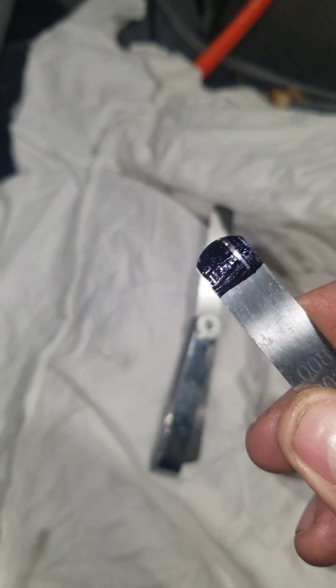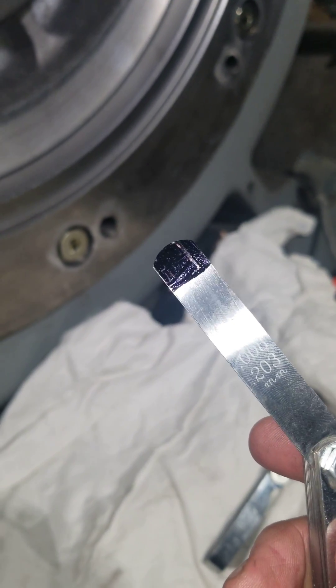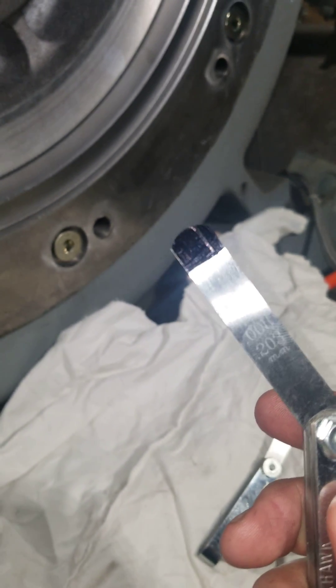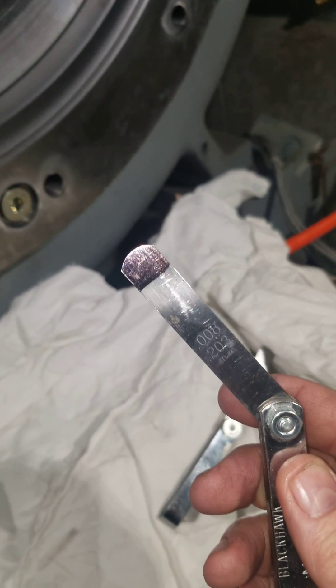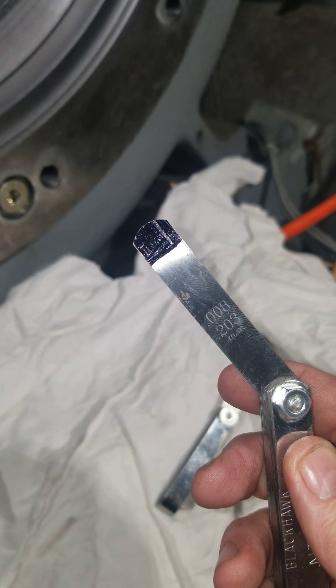And if you can see that, there's a little bit of a scratch in there. While it got in there, it was making good contact. So I'll sit there and maybe flip down to a 0.7 until it doesn't make contact, and then I'm really confident I have the right tip clearance.